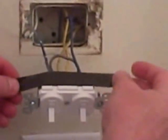Now we're going to turn the electric back on and make sure it works. All these switches are going to have a grounding screw — in this case there's no grounding wire here. I've got the electric back on and we'll test the first switch. That operates the light, which is much more convenient when you come to the bathroom, and the fan works also. I'm going to turn off the electric and wrap some electrical tape around the terminals all the way around the body. That will help protect in the future if someone removes this switch and leaves the electric on — it won't give them a chance to ground it out against the body of the box. Those are the steps to replace a double switch in a bathroom.